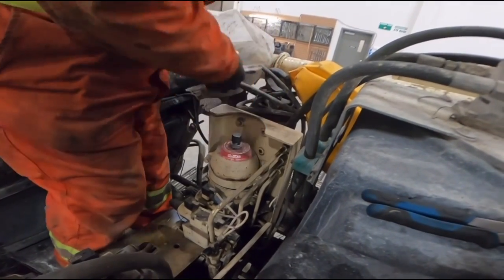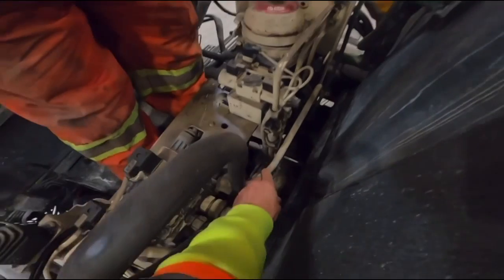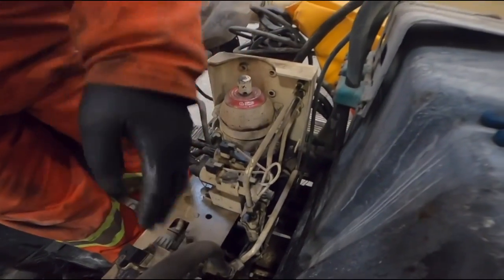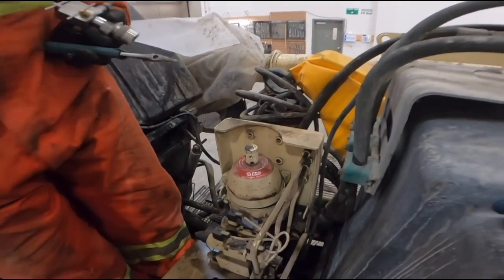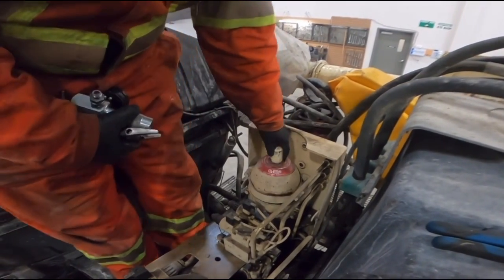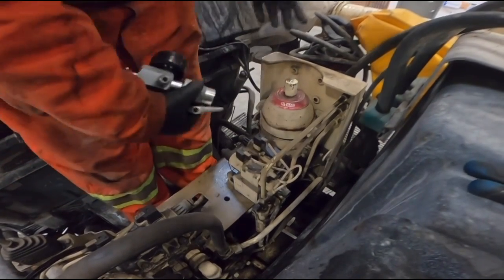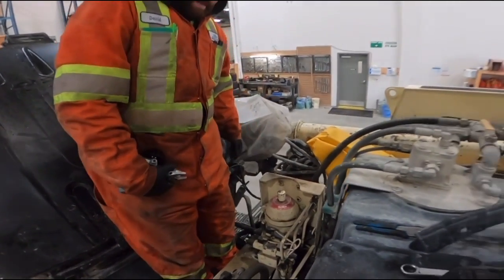That's all there is to it. So it connects to this big line at the bottom of the bottle, right? Yeah. If you want to swap the bottle out, you just undo the four bolts there, and the one line, the nut on the bottom, and away she goes. On this style, it's absolutely horrible, because you have a steel line, and you're underneath trying to tighten it and hold the bottle correctly. It's a fine thread, and it's a pain in the butt.